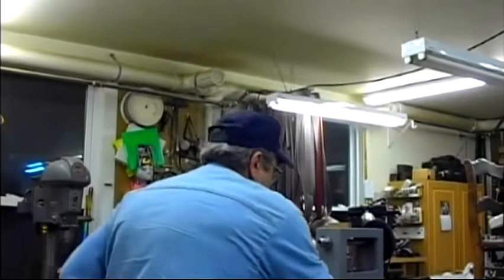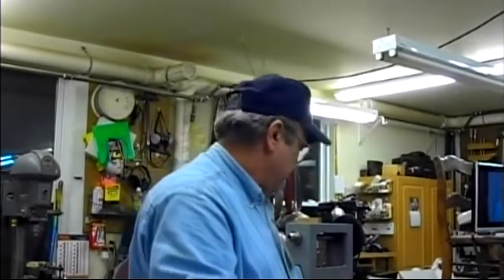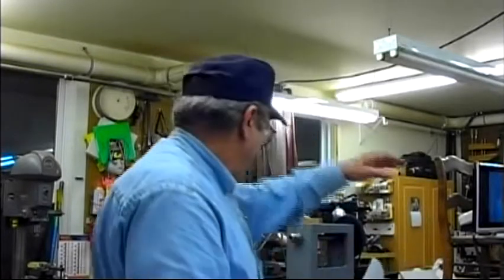And they have a chuck for everything you can think of, and cutting tools for everything you can think of. The Holtzapffel engine I told you sold on eBay had 100 chucks that came with it. I forget how many cutters. It was incredible. We're not talking standard chucks like we're thinking of, because they didn't have anything near that. Different chucks that would throw things in an ellipse, and anything that fit on a spindle in those days was a chuck. Anything to fit on here, for the most part, was some kind of cutting frame.